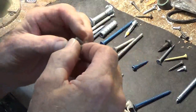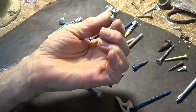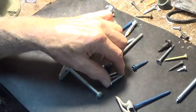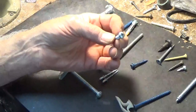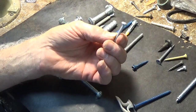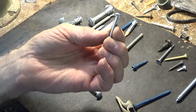This is mostly for sheet metal because it's so small, it doesn't have a lot of threads hanging out — it doesn't bother anything. This is the other sheet metal screw we were looking at. There's no blank shank; it's got threads all the way up. That's the way you can tell between sheet metal and wood screws.